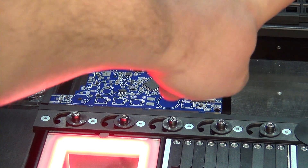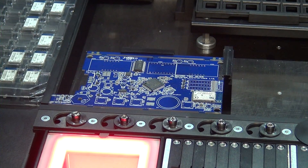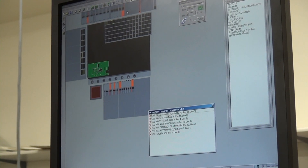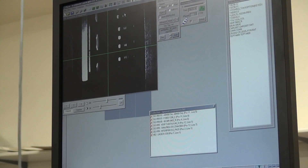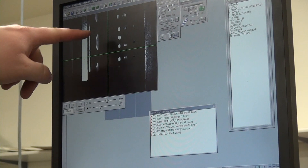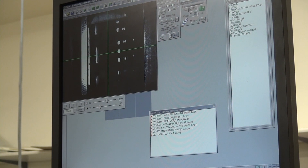That's kind of over there, so I'll show you that in a second. And then one over there is just a really super tiny component — it might have just missed it. So we'll take a peek at the screen here. Taking a peek at the screen, you can select one of the components that didn't place. As you can see, it's pretty dark, but I know where the component is. What we can see here is it's trying to aim for the middle and it's not lining up. So I'm going to line it up in the middle like so.